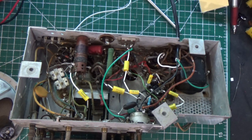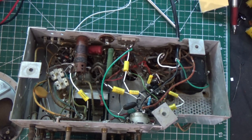In part six, when we really start digging into it, we're going to troubleshoot the audio section — assuming we didn't hear the 60-cycle hum. In this radio we know it's working. In part six we're going to start troubleshooting the RF section, assuming we got the hum, and show you what things you can check minimally to understand where your problems are. Let me set up that test with the center terminal of the volume pot wiper and we'll be right back.